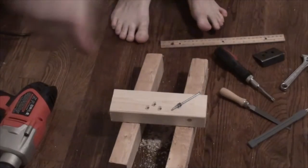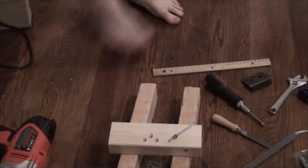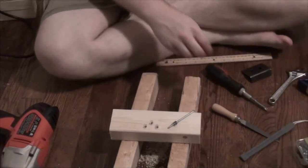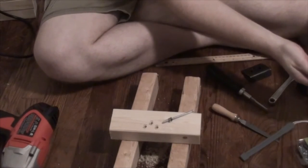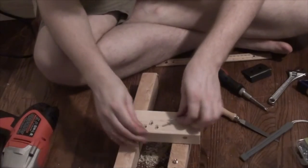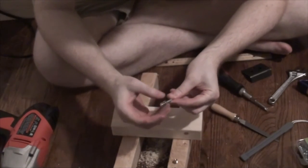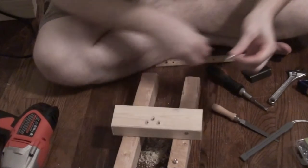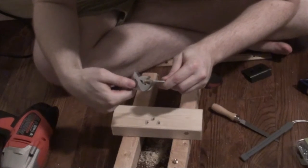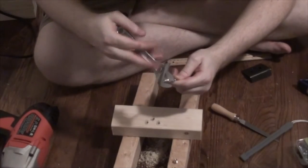Next up is threaded inserts. Installing these things is kind of interesting — there are apparently a few different ways to do it. I looked online and the agreed wisdom is to use a bolt in a drill press with two nuts on it, tightened up to the insert to hold it in place by friction. But bolts for this size — this is a number eight machine screw — just don't exist at that size. So I just got a really long screw and I'm going to install it with a screwdriver. So that threads onto there. Basically I thread the insert onto there and tighten up the nuts with a wrench. I have the screwdriver on the other side to hold the long screw in place because otherwise it would rotate along with the wrenching.